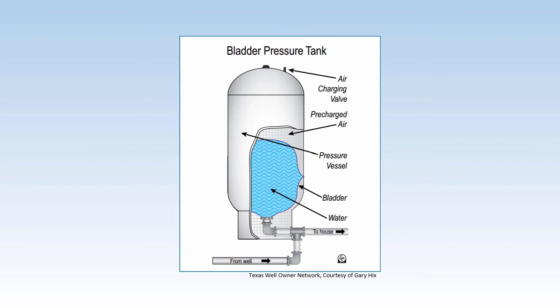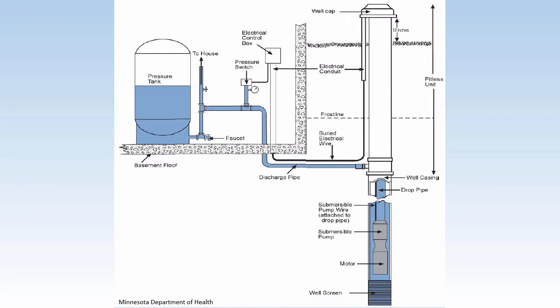A contractor will also be able to tell you if there's a problem with your tank. Next, ensure the water is free of sediment that can damage the pump and piping. To find out if you have sediment in your water, you can check the bottom of your pressure tank — draining the tank should show you if there is anything settling. Another possible place to check is in your toilet tank, where sediment sometimes settles. If you find sediment, determine the texture: if it feels chalky or silky, it is likely fine clay or silt, which is less damaging than sand, which has a more abrasive feel that is also working on your pump and piping.